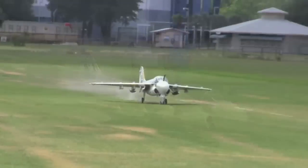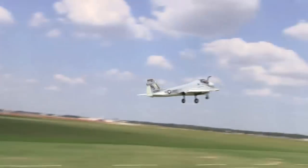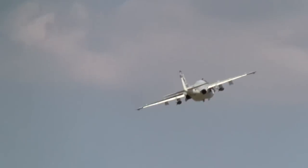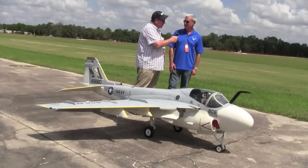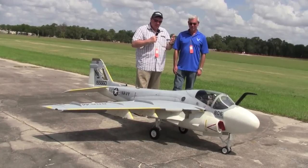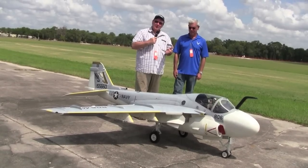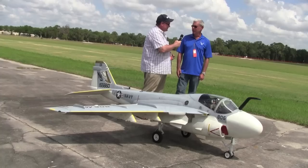To keep this light, the formers are all made from prepreg carbon, Nomex, or Herax. There is probably about three ounces of wood in the plane total. Even the landing gear is titanium. It's probably one of the most scale and certainly most unusual aircraft here at Top Gun. Thank you very much for your time.